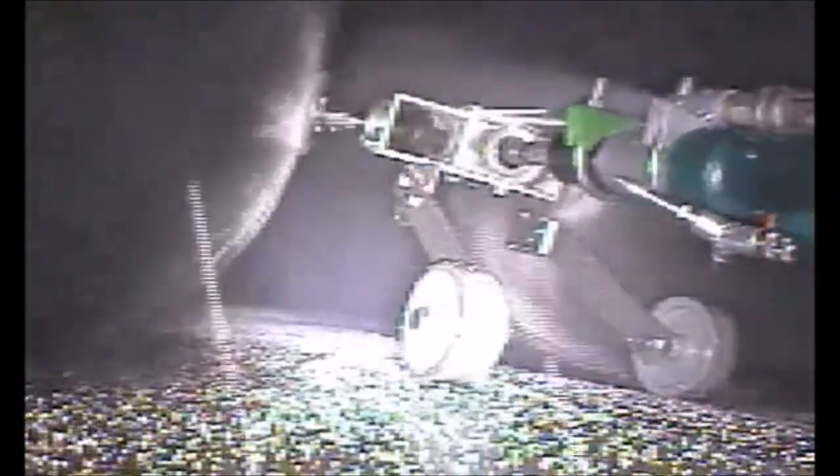There's a closing valve in this end of the hose also. In smaller ductwork and longer distances, the granule spreading hose can be connected to the hose of the cleaning machine. The connection is designed so that the Y gear for rotating two brushes at the same time can also be used. Before starting the removal phase, it's advisable to remove the granule spraying hose, even though it could be used as an extra air-jetting device in case the granule container is empty and there's a good enough compressor connected to it to make an actual extra blowing effect.